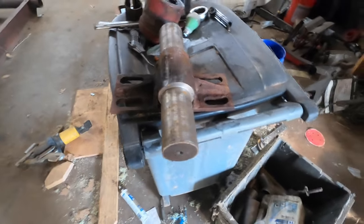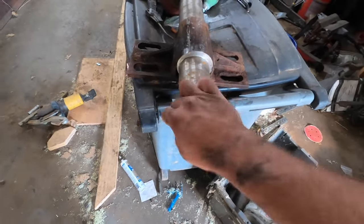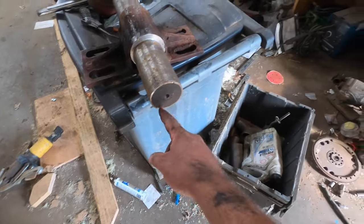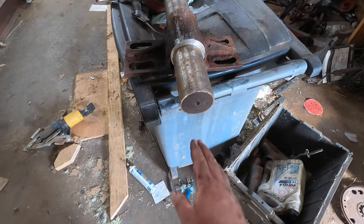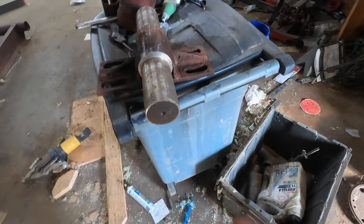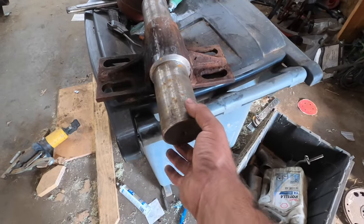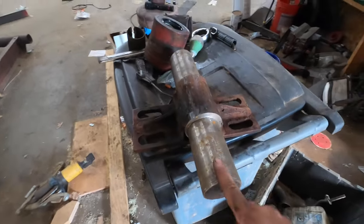Anyway, what was interesting about this, it was neat to watch in the machine. You know, all the wear was in the bottom. There wasn't any wear on the sides or the top. And so this thing was shaped sort of like a football. And anyway, I put a center in it. You've got to kind of measure where you think it'll be to make the biggest round circle. You know, when the center is in the center of it now, but when you start, it's offset. And anyway, then all the material that you take off is off the side that's worn. Anyway, this just cleaned up. Both of these are just cleaned up. I didn't take any extra off. But anyway, I wish you could see that because it's pretty neat.